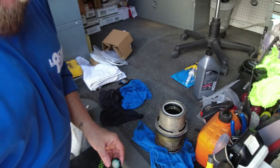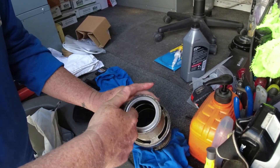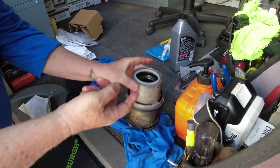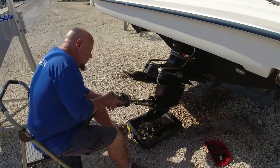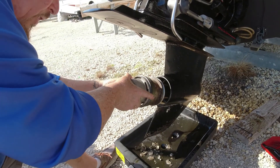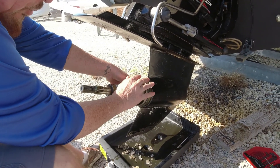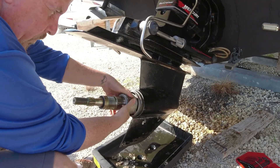Over here we're going to get a little bit of the out drive oil — not grease but the oil — put some on my finger and lubricate the new seal all the way around before we put the carrier back in place. That's the only thing needed: just lubricate the seal all the way around, and then we're ready to install it on the shaft. We already cleaned all the debris out and we're ready to put the bearing carrier back in there. Remember the thread is opposite — too tight is to the right normally, but in this case tight is to the left — so we turn it to the left. Make sure we don't cross-thread anything.